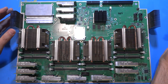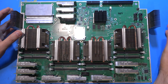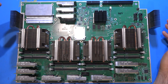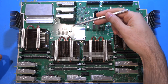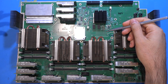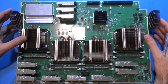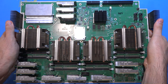Another component here is most likely an FPGA — some glue logic, just putting things together, and a PCI Express lane. There's some stuff here that's a little interesting — let's see if you can catch it by the end of the video. There are two connectors here that connect the front end to the main acquisition board. These are hybrid, meaning they pass DC, potentially clock, and analog signals, and they have to be quite well designed. It's fairly common to do board-to-board construction like that. Let's go ahead and separate these.